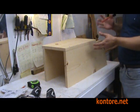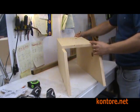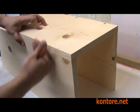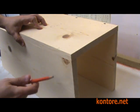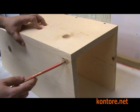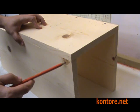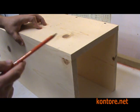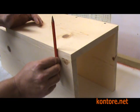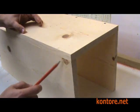Now that one side is fastened, rotate the entire unit so we can get at the other side. The alignment process is the same — flush at the bottom and flush at the side so everything lines up nicely. An important point to watch for with pine is that you'll often have knots along the edges. You really don't want to drill or screw into a knot — the wood could split and it's hard to drill through. As you're assembling, look at where your marks are and make sure they're not going into a knot. If they are, shift them a little one way or the other to avoid it.